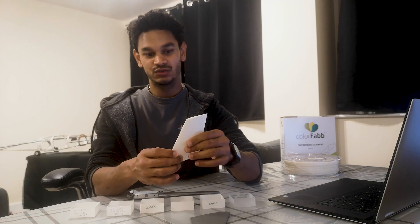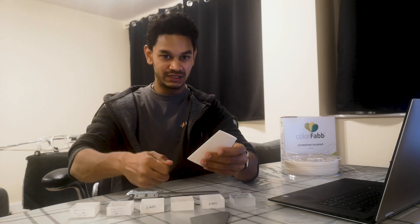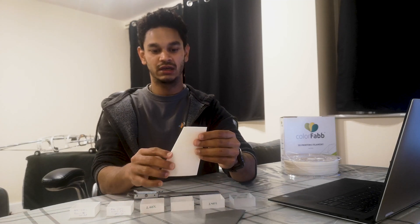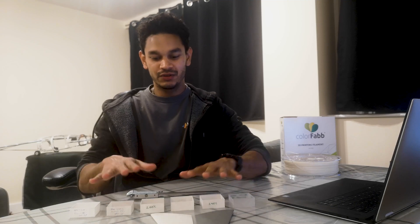The other disadvantage is with supports: because the material expands slightly into surrounding geometry and is flexible rather than brittle, supports are very hard to remove — like pulling on a hardened marshmallow — rather than snapping off cleanly as they would with normal PLA or ABS. So be conservative with how much support you use. I hope this video was helpful and gives you the confidence to try lightweight PLA. Thanks for watching!